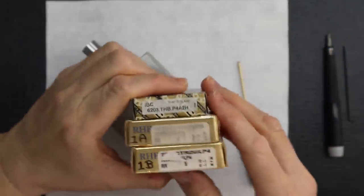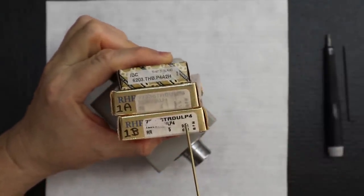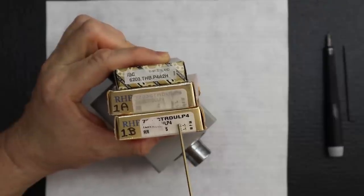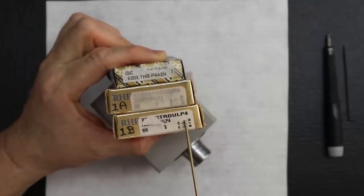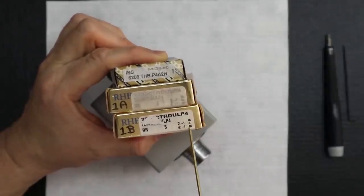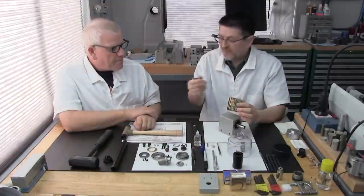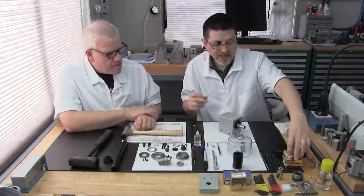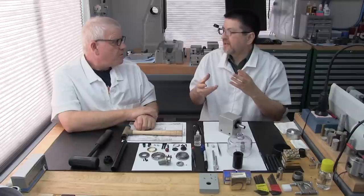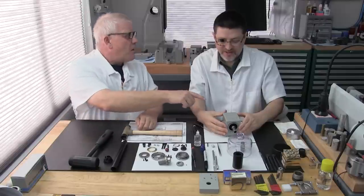We've explained these before, but these tolerance markings on the bearings indicate the tolerances on the internal and external bearing races. Where this is a -1, that means the outside and inside bearing races are 1 micron smaller than the dimension for that bearing size. And each set can be different. We've seen threes and fours and twos. It affects how hard it goes in or out.